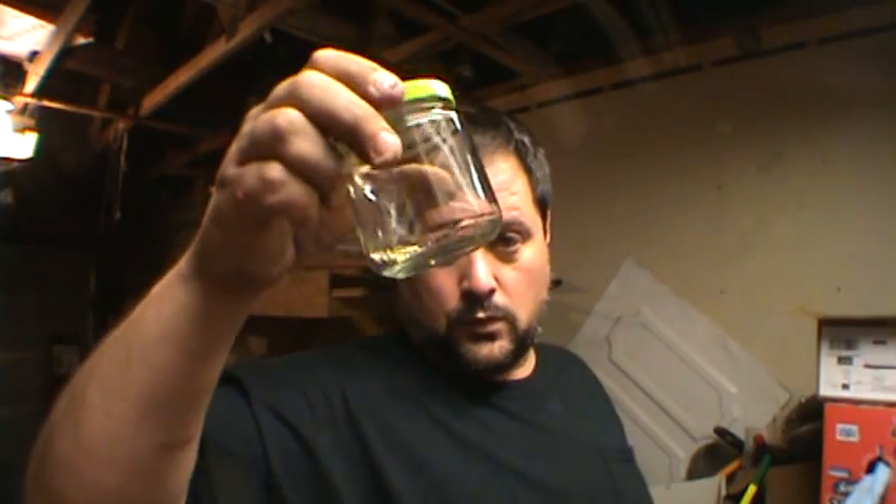So you've got your pins, starting to save them up. The first step is going to be to collect a whole bunch of pins to fill up this jar. And the next step is going to be a hot bath in hydrochloric acid to dissolve the ferrous material underneath the pins, letting the foils float to the top.